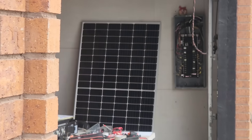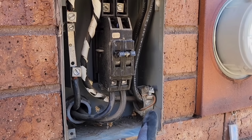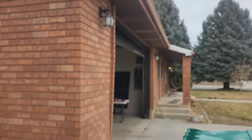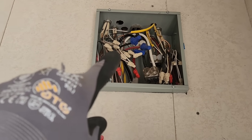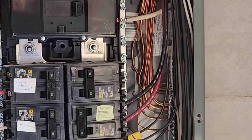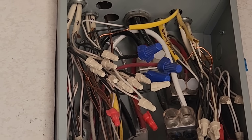I went over and looked at the electrical panel, and I noticed there's no ground neutral bond in this panel either. When I opened this electrical panel, I noticed there's not even a ground wire that goes into my house. What they were doing was running a metal pipe from this box into my attic and over into my main house electrical panel. The metal pipe comes through the top, and then I have a grounding lug, and then there's the aluminum grounding wire that comes down and connects onto my grounding bus bar. With the code in the United States, they allow you to use metal conduit for your ground conductor.